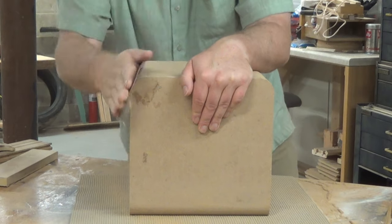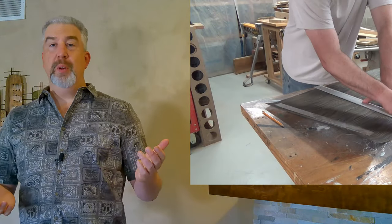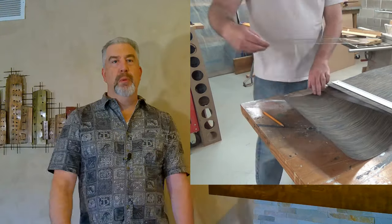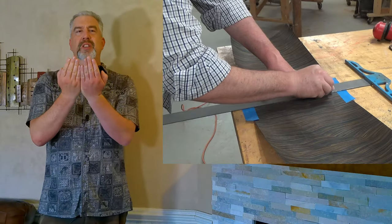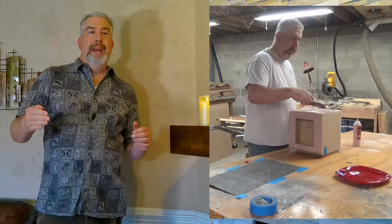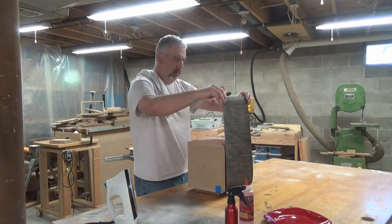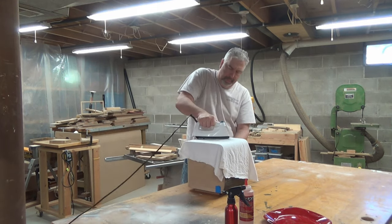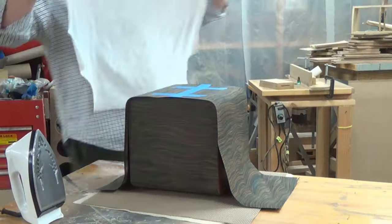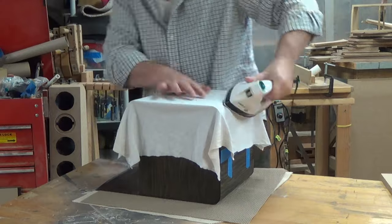After a bit of sanding to finish smoothing out those curves, it's off to pick out some veneer for this project. I'm going with a man-made veneer that has some interesting folded grain patterns in it. I really like it a lot and it wasn't even super expensive - I'll leave a link in the description below if you're interested. I have to join two pieces of veneer together as the sheets weren't wide enough to wrap around the front and both sides. I'm using my preferred iron-on method to adhere the veneer, and I gave each application a good 10 hours or so to dry before trimming, since it may shrink slightly if you trim it too soon after ironing it on.